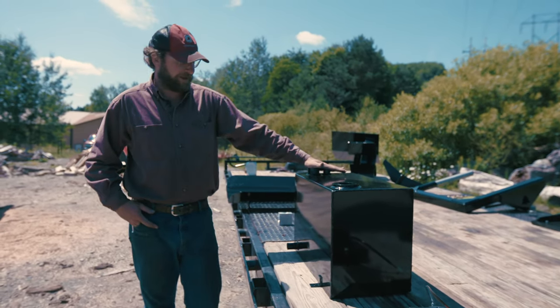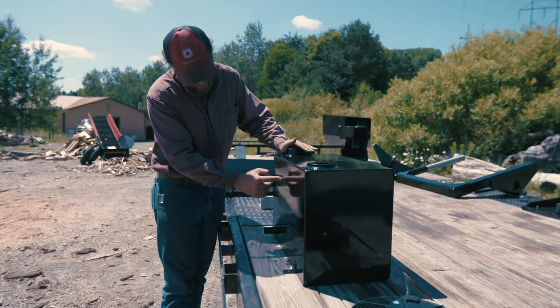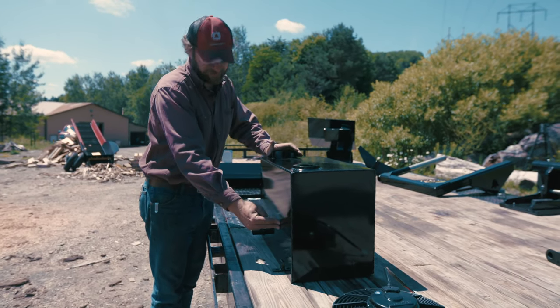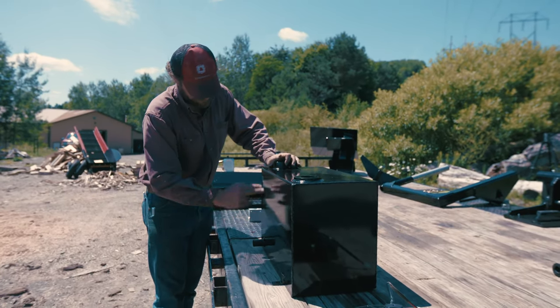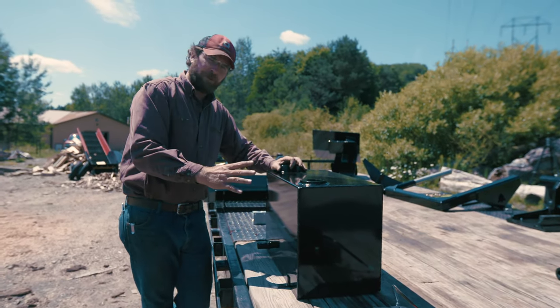Now these sit up high here. If you look inside, these are going into a bent tube, and the tube falls about a 30 degree angle all the way over here. In between the exit of your oil and your suction line, we actually have a baffle that's welded in like this. And there's some holes and passageways in there.